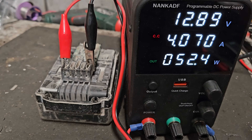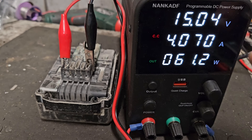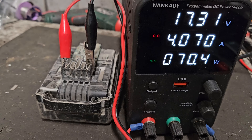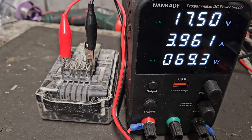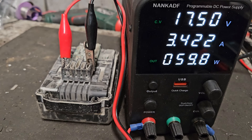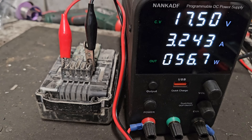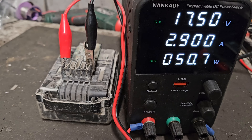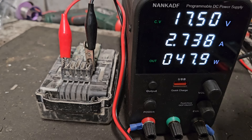You can see the voltage going up — it's bringing up the voltage quite quickly, with four amps going in. It's giving it a full blast, and importantly it's not heating up the cells the way it would with connecting another battery to it. That jump-start method can work if you're on a job site and you need to get out of a problem, but I don't recommend it in a workshop environment. I recommend you own one of these power supplies.